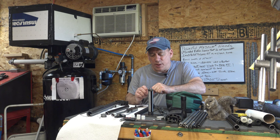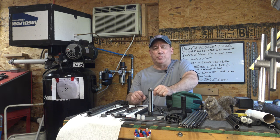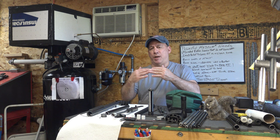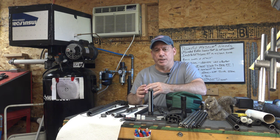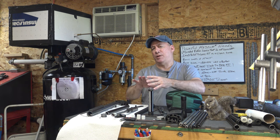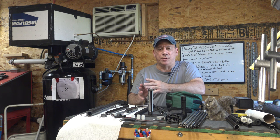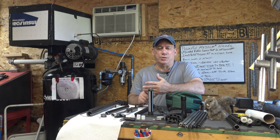The second thing I found: the breech seal. It has a nice wide breech seal — typical seals aren't that wide, so that's good — but it's also very hard. In a magnum gun, if you create too much tension between the receiver and the barrel block, it can cause the barrel block to jog a little when you shoot. You need some tension on the breech seal, but it has to be in a certain range — not overdone. The material should have been a bit softer.